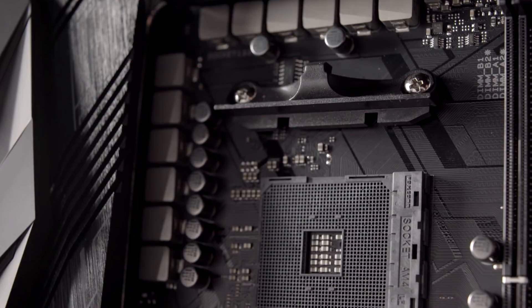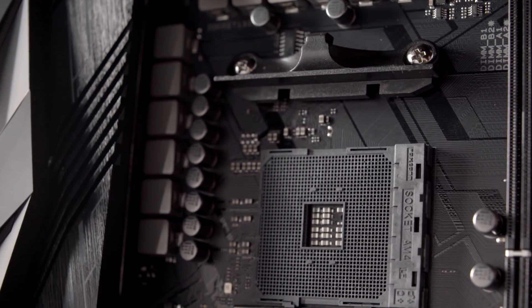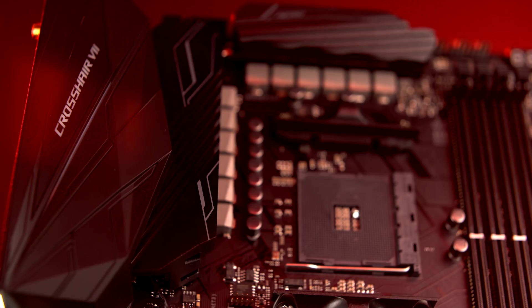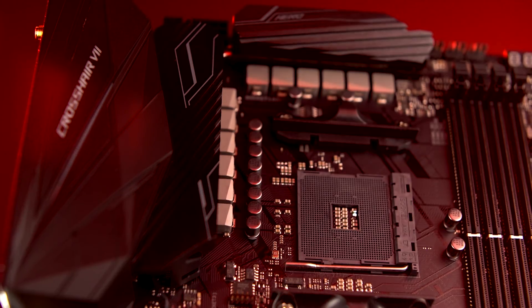With a board like the Hero, it's not just about the aesthetics or the look and feel — you're definitely concerned about overclocking. In fact, many enthusiasts pick ROG series motherboards specifically for their overclocking design and overall capabilities. The Crosshair 7 Hero has really been purpose-built to offer a truly impressive overclocking experience. It features far more robust VRM than our Strix series boards, with significantly upgraded power components including 10k rated capacitors, NexFET MOSFETs, and advanced power stages.